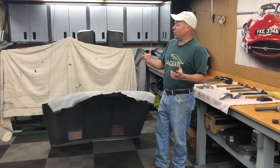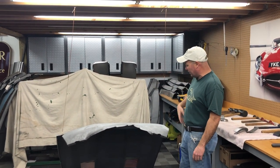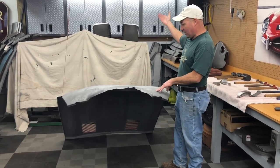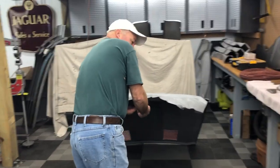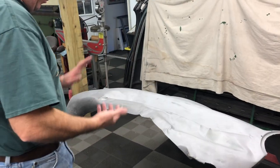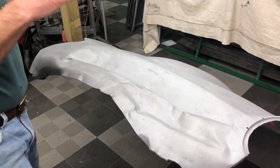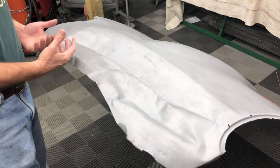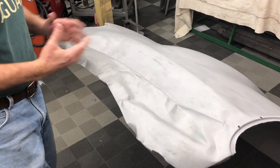This is just a quick segment to show you how I hang these from the ceiling like this with the back edge on the floor, the main support member there. Sometimes I'll pick that up, but I will either stand or sit here on a stool and be able to work it like this. Next we're going to flip it over and start pushing this out. What's nice about this is that it is a virgin wreck — nobody else has gotten in here before me and beat this thing a thousand times with a ball-peen hammer. That will stretch the hell out of this.